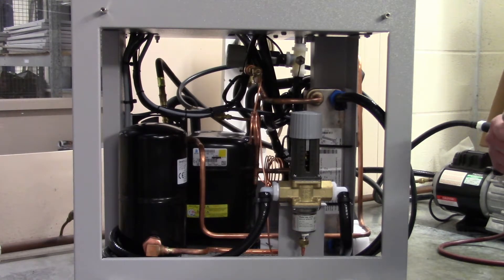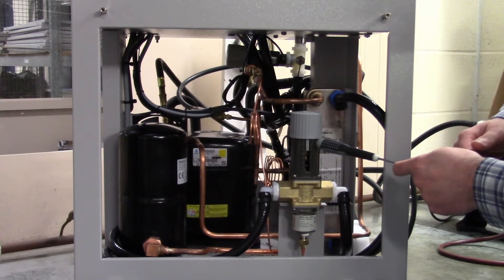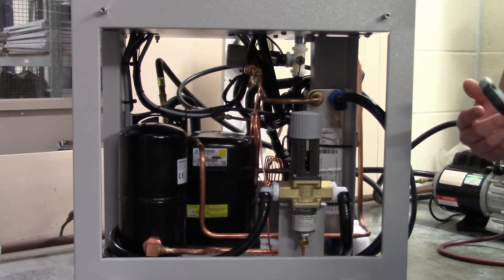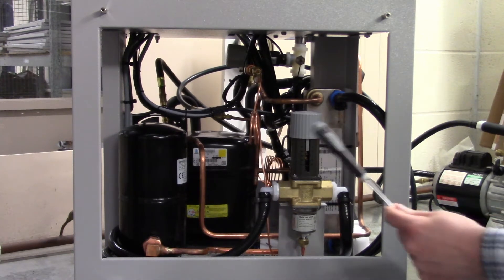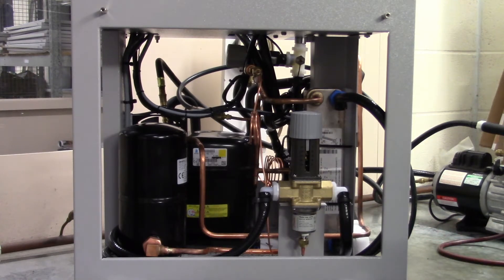One of the more common service enquiries with water-cooled chillers is the setting on the water regulator. This device is factory set, and when you're first connecting up to your building water supply, you need to turn the chiller on so that the chiller is operating. Otherwise, head pressure in the capillary line will not build up, and the water regulator will not allow water to flow. This will lead to the false presumption that there is a problem with the chiller, or perhaps that you're not getting enough house water through the system, when the reality is that with the chiller off, the head pressure is very low and the water regulator is doing what it's supposed to do — it's stopping you from wasting water.